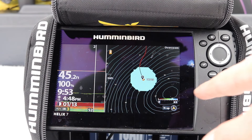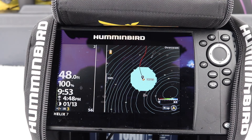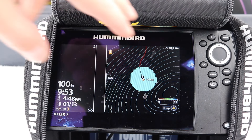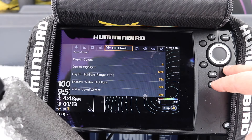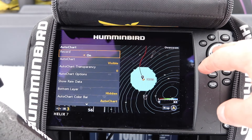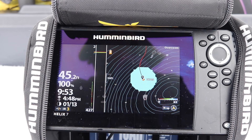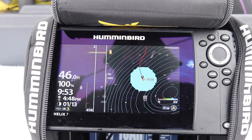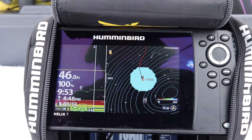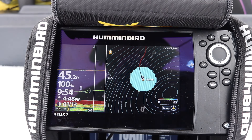As for Auto Chart — I've already done auto charting. If I pull the transducer out, the reading will disappear and it's going to start guessing: a thousand feet, 500 feet. If my Auto Chart is on, I'm going to get mixed readings. I want to leave it off, otherwise it would show a thousand feet or 800 feet. If Auto Chart was on it would have given me a depth of 300 feet and it would have misled my auto chart data. You want to turn off Auto Chart the minute you're going to pull the transducer — that's a big tip to save your maps. Then you can go from hole to hole, click Auto Chart, and it'll populate them.